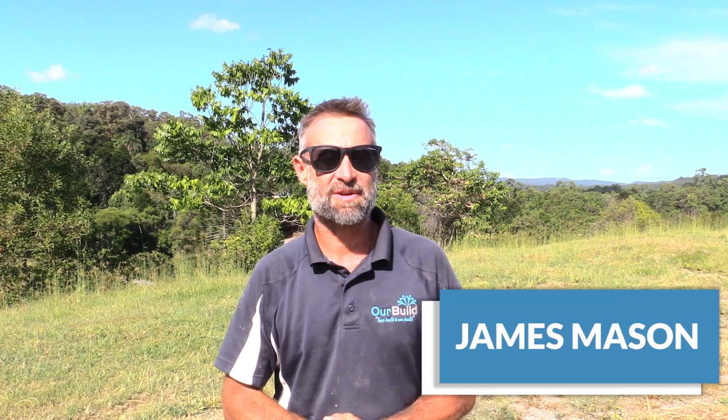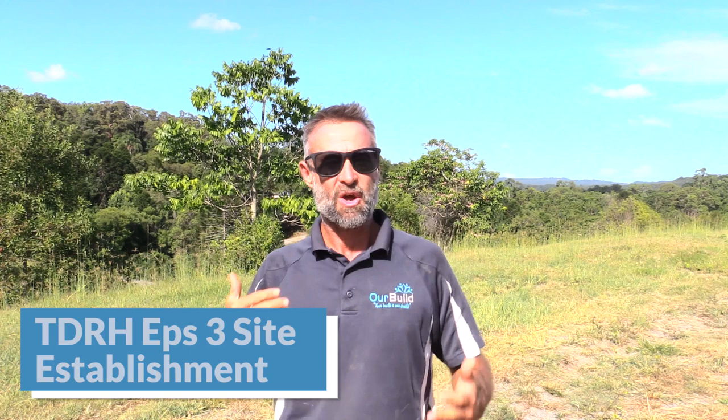Now what you can probably hear in the background is an excavator. It's a machine behind me. We're coming in and we're starting to do some of the site preparation. Now what that involves is actually cutting back one of our berms that we've got here, just reducing some of the old shrubbery, taking down a tree that's going to be in our building envelope, and just basically preparing the block with a bit of trenching for some power to come in if we potentially do power to the site. Some water and a few other bits and pieces.